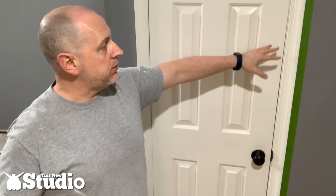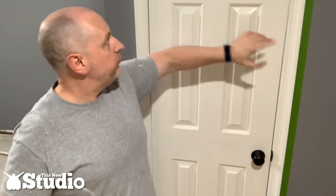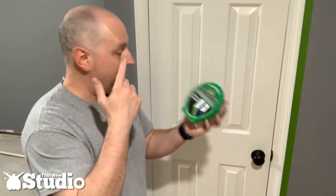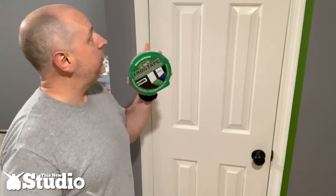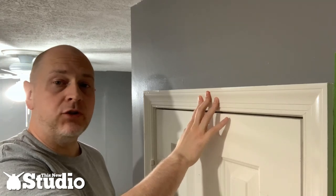Let's tackle the existing trim. As you can see by the green tape alongside the door, I've already started taping up the perimeter. I'll show you my techniques — not very complicated but there are a few things I do for nice results. For tape I like to use FrogTape — the green frog tape. Yes it's more expensive, but I've gotten better results than with 3M painter's tape or regular masking tape. Let me show you how to tape off the edges.